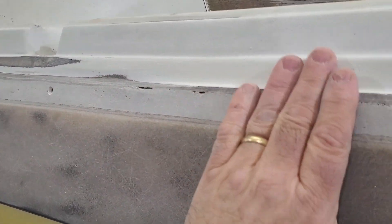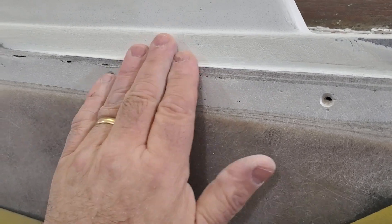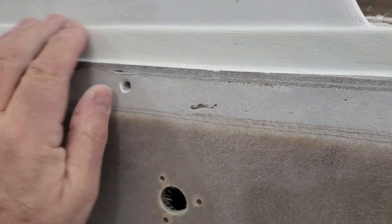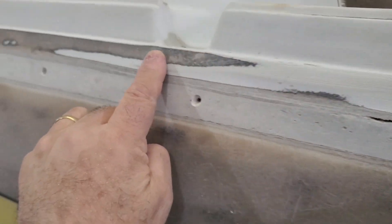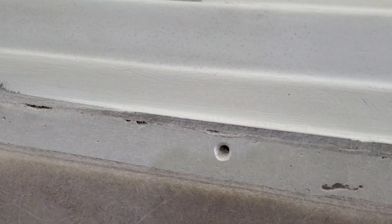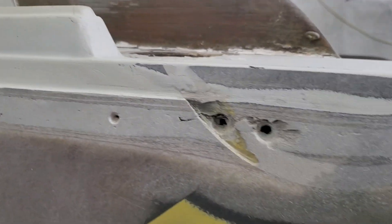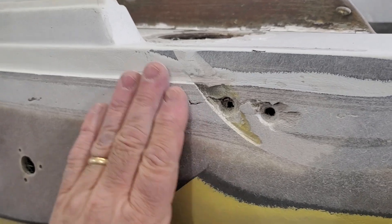This part here — this deck molding sticks out too far from the hull. I can't sand this part flush with this toe rail up to this line here, which is where I've been sanding to on the rest of the boat. So I'm going to have to fill this nice and flush and smooth in there, and we'll just massage this whole area so that it blends in when all is said and done.